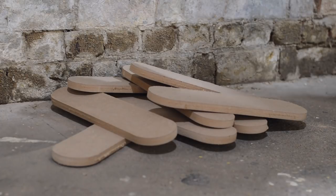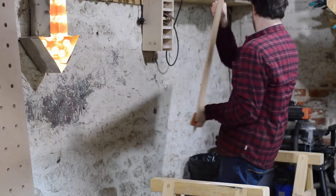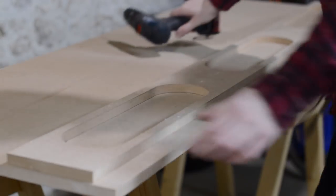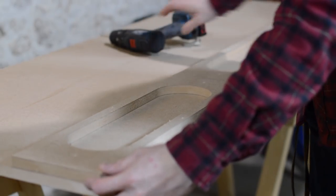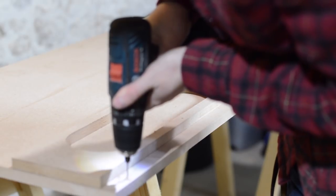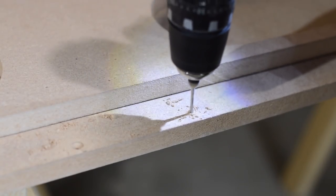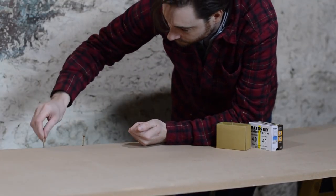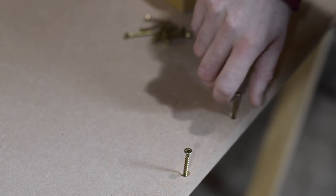You just need to put them together now. So this is a six foot by two foot board and this is going to be the base. I lay one of the sides on just so I can see where I want the screws to go — I don't want to be driving any long screws into where there's a hole. I can then drill some pilot holes and I'm using a drill bit with a countersink built in. While I've got it this way up I go around and put loads of screws in all the holes and just twist them in by hand, which is going to make it a bit easier later when I'm working underneath it.